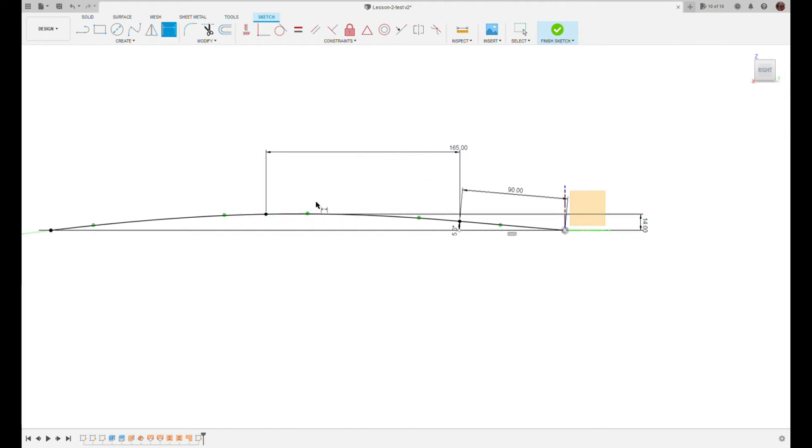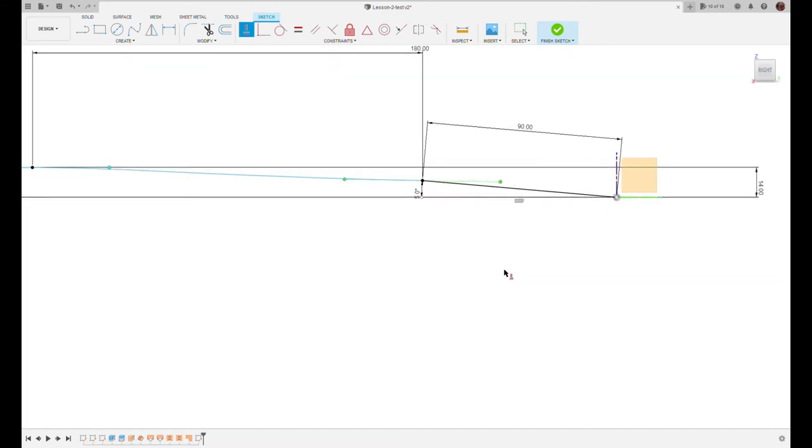I like my bridge to be on the higher spot, but you know, with the scale length it changes a little bit. I find that it works right between 200 millimeters and 165 millimeters, but let's make it just right, maybe in the middle, 180. Okay. Then I want this one to be horizontal, and I want this one to be tangent to my neck plane. So the curve will be smoother and the final result too.